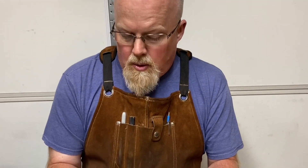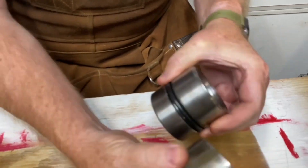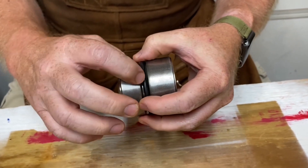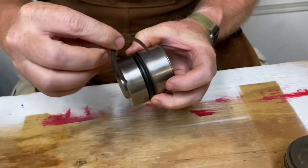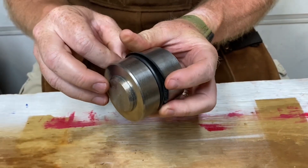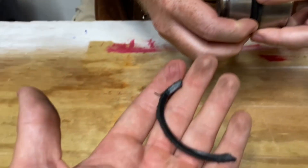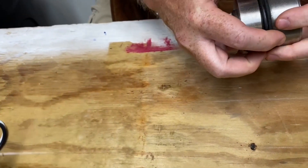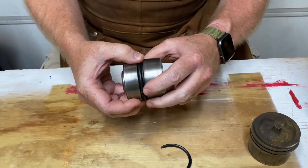After this design, the Jubilee or NAA tractors went to a new piston style — similar in diameter but with a different sealing method. They used a rubber O-ring with a leather backer on the other side. The purpose of that leather backer is so when pressure is applied, the backer pushes against the metal and keeps the O-ring from rubbing and wearing on the cylinder wall.